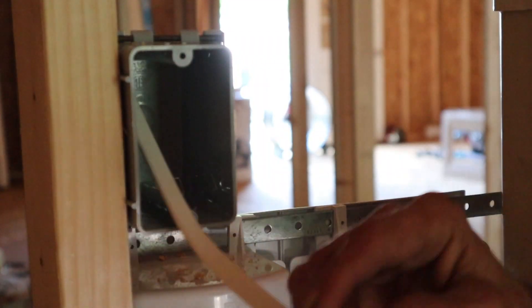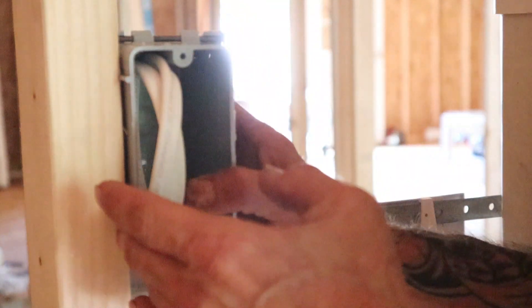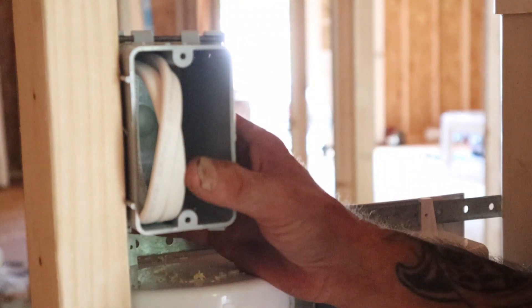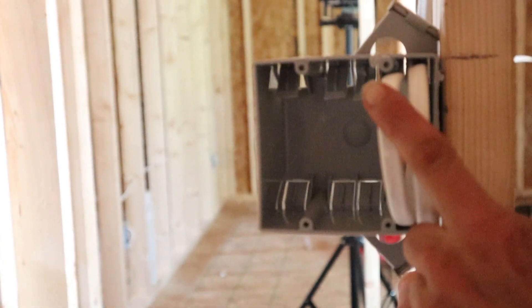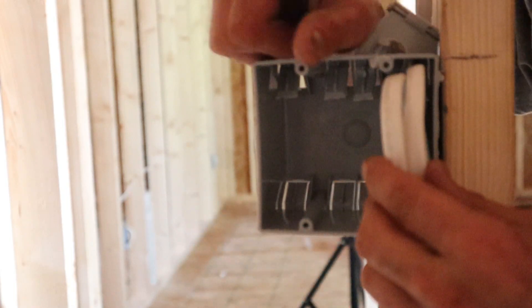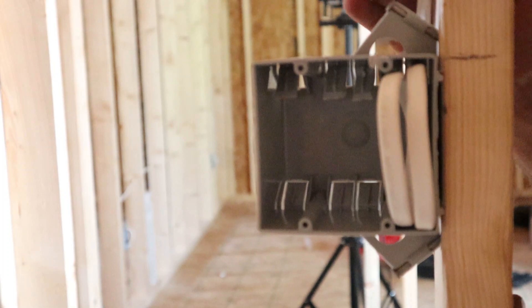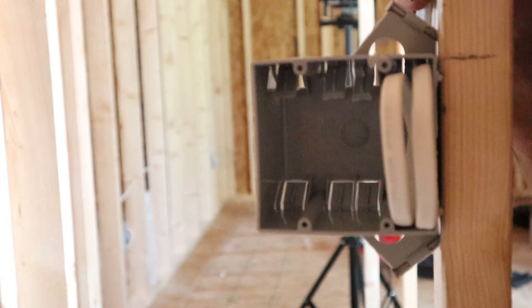Down here at the box we're going to take the excess wire that came from the panel, roll it up and set it up inside the box. This is going to be a one-and-done complete circuit just for this outlet. We're going to leave it sitting right in there and not put any outlet or cover on here until the finished wall is put up — but now it's there and out of the way. We have our power coming in to our box for our lights. Eventually I'll have two more lines that come out — one going to the vanity lights and a single overhead light. It might seem like a little overkill, but everything in this build is done right because I want ease, comfort, and security knowing that everything is done more than it has to be so we don't have problems down the road.